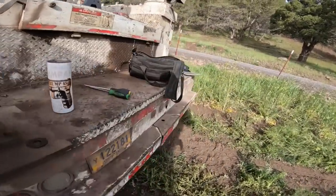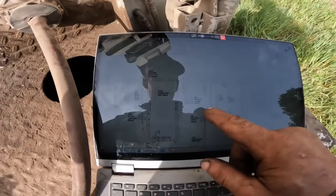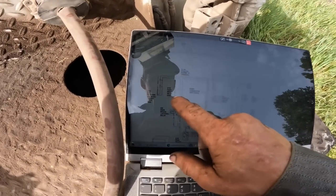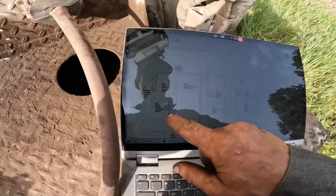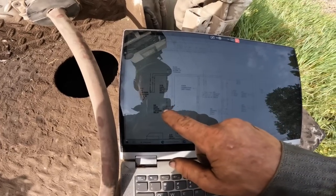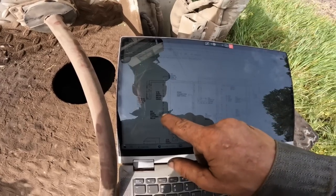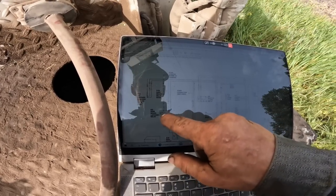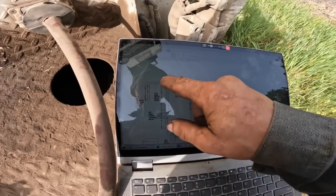So, what's going on here? You look at the wiring schematic. Okay, here's our diode we replaced. Now it's all making sense why the diode shorted. We're losing the ground connection to the starter, M1 starter motor S terminal, to pin 1 on the park brake latching relay.